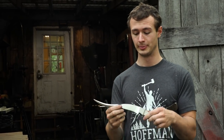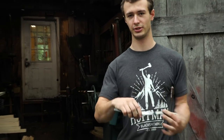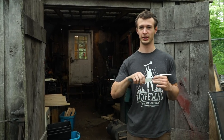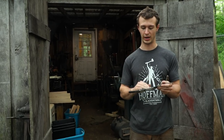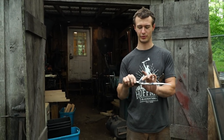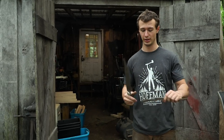And one thing I wanted to talk about when it comes to grinding is that when you're grinding, it helps if you think of it as if you're sculpting the steel. So you're walking up to the grinder and you're just sculpting steel. You're not grinding steel. You're taking the edge of the belt, you're taking the contact wheel, and you're sculpting the material into what you want it to look like. And just thinking of it that way helps me actually grind better, especially when I'm doing shapes like this with weird cross sections. You know, it's going from a flat into this swooping plunge into a square spike. So it helps to look at it as if you're sculpting metal, similar to forging.